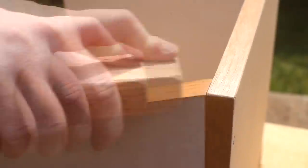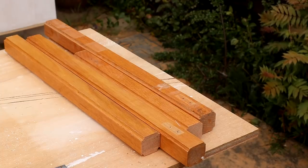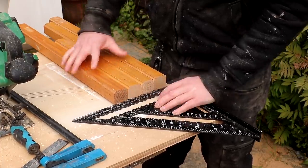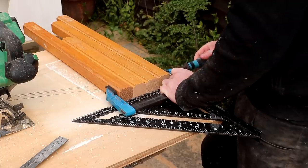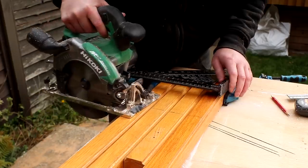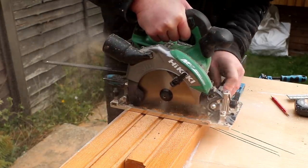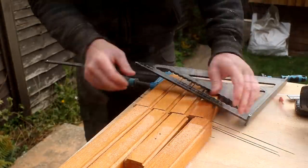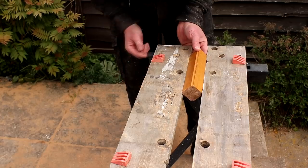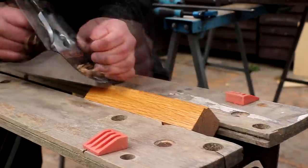I wanted to make a leg base for the cabinets too. For that I'm going to be using some salvaged oak hat and coat stands — regular viewers of my channel will be familiar with these as they've been featuring in my projects for a long time. I flushed up the edges using my speed square and then clamped them together, then I can mark up the length for the legs and cut them using my speed square to guide the saw. These pieces of oak have fluted corners and I don't really like that look, so I clamped them into my workmate and used my hand plane to bevel the corners instead.